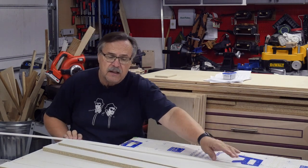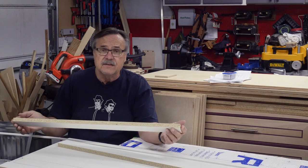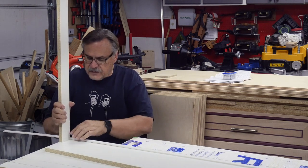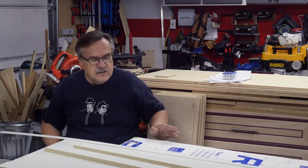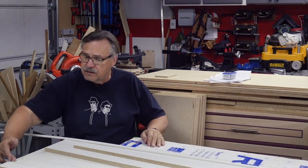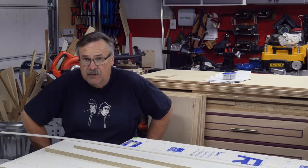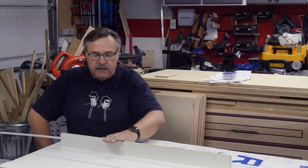I made these leg pieces that will go in each corner and one in the center. They're already ripped on the table saw and cut to the exact height of the bookcase so everything matches perfectly. I'll screw them on first because the screw holes will be visible on the top surface, then the trim piece will cover them up. When I take it inside, all I have to do is set it right on top of the cabinet — the bookcase spans about 13 to 14 inches and these legs hold it up. If I ever want to move it, I can easily make that adjustment.